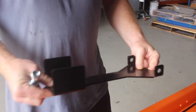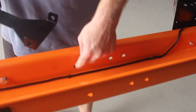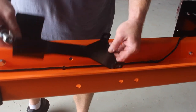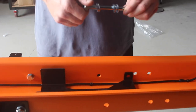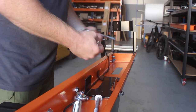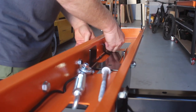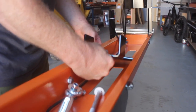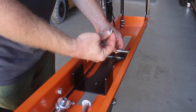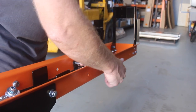Next, this is what I call the rear wedge — it sits behind the front tyre. There are three holes and two positions: the further away hole is for a 21-inch front, and the closer one is for a 19-inch front. We're going for 21. Lay that there, take the nut off. There are seven washers here. Put one washer on the bolt, two on the inside, then put it through the wedge. Over the other side there's a bit of tolerance for the folding — sometimes you'll fit three washers there, sometimes two. Then put another washer and nut on the outside.